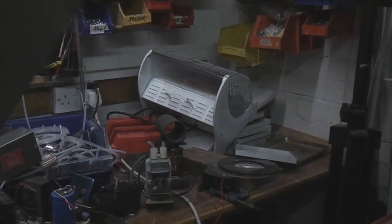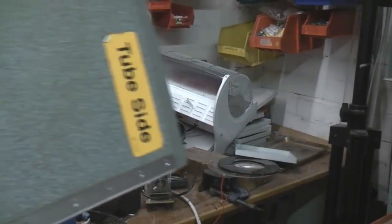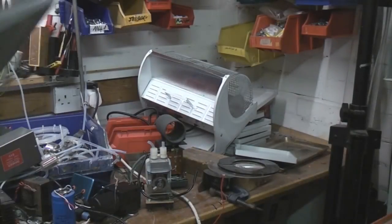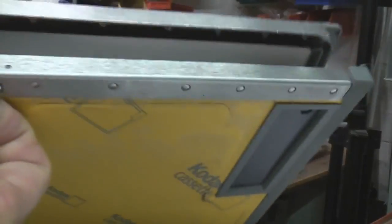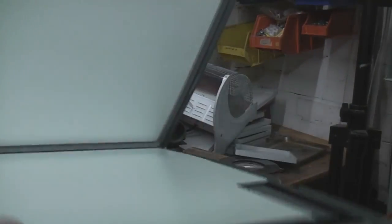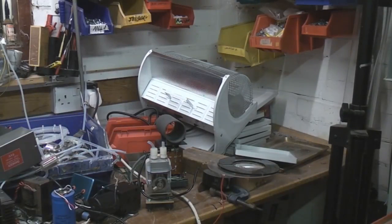I bought a couple of X-ray cassettes off eBay a while ago just to have a play with. This is the plastic material out of one of these. These are normally used for most film-based X-ray processors, because it just allows you to get images with less X-ray energy. So instead of relying on the effective X-rays on the film, it's sandwiched between two sheets of material that glows under X-ray, so that light helps expose the film. That basically allows you to use less X-rays, but it does reduce the resolution to some extent. For the better resolution, I think they normally use just pure film, but you need a higher X-ray dose to do that.